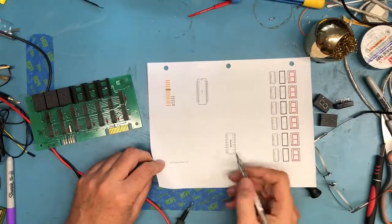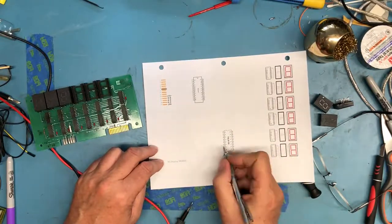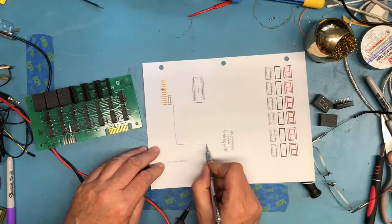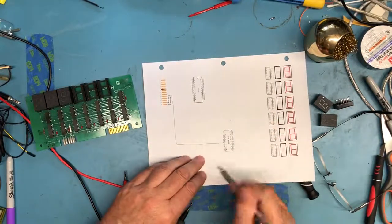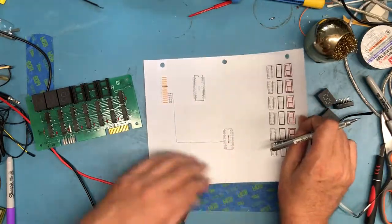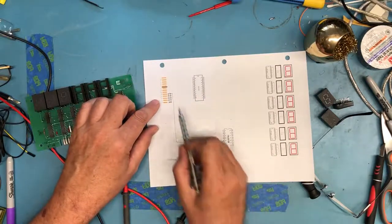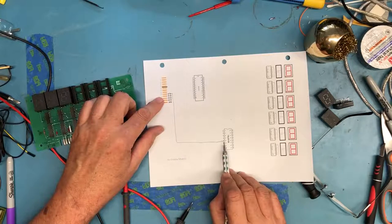So we already know at this point, and I of course drew that in the wrong place, on pin 5, that this signal comes over here to this enable pin. Let me clean that up, draw that a little cleaner. Trying not to get my head between the camera and what I'm drawing. So we know that these pins here, I'm almost guaranteed one of these is going to be taken low to select the device.